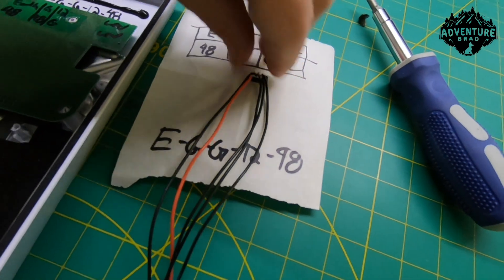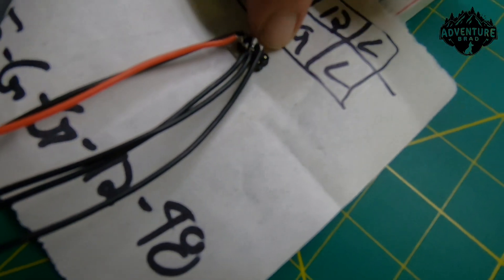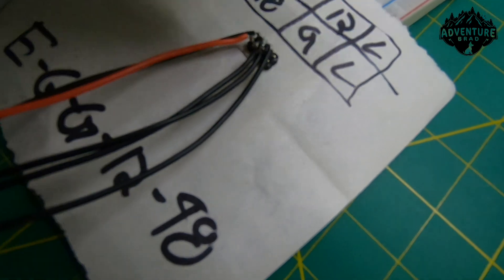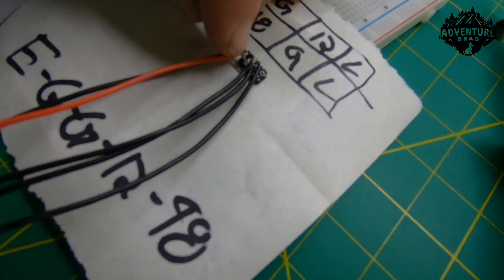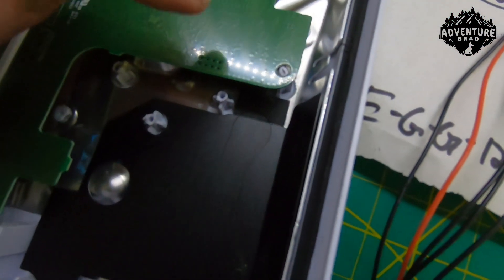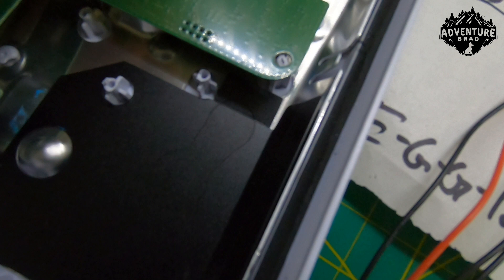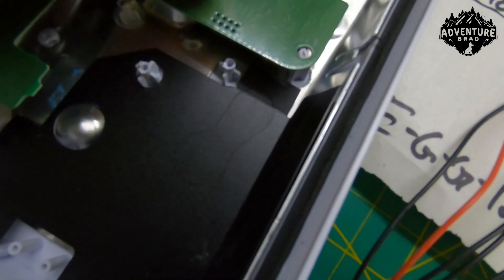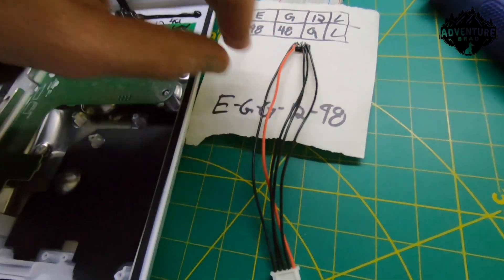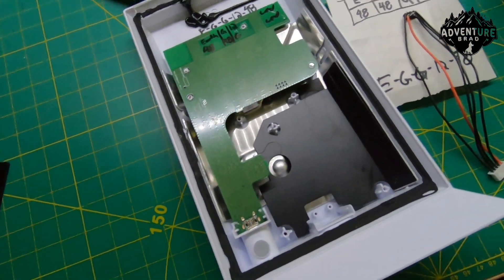This connector will now plug into the back of the board. I left it open but I'm going to glue it — I cut down the LED-size pins and put them in for orientation. I'll glue the edges with super glue, put little pieces of plastic between the voltage differences, then electrical tape. Once it's on the board I'll pot it all onto the back. There are no components I'm worried about pulling off, but it'll be semi-permanent since I'll still use this pigtail when I move it into its own box.